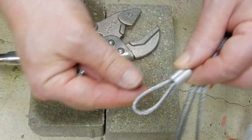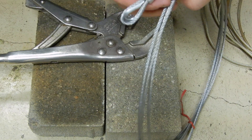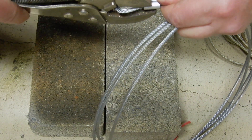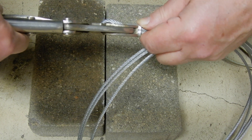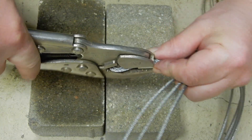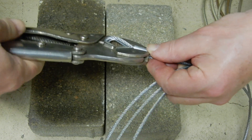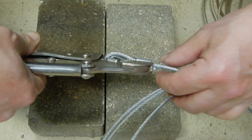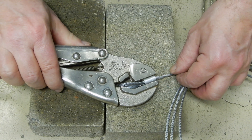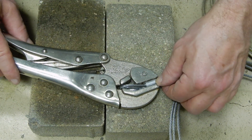I've prepared the wire rope with the ferrule. You can see I'm building the loop here, preparing to do the loop. I'm going to put it right in the middle here. It's important that on the bottom, the ferrule is slightly lower than the vise grip itself — because we are going to hammer on it, so it should be a little bit below that surface. When I put it on the brake, it's not the clamp that is going to hit the ground, but the ferrule itself.